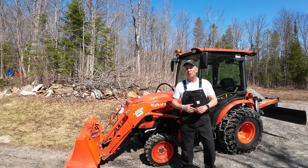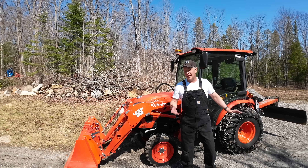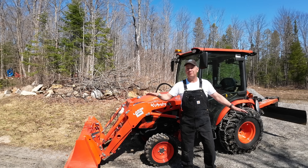I know that this loader and that bucket weighs somewhere around 550 pounds — that's what it says in the manual. I also know that I've thrown over 500 pounds of rim guard in the rear tires. So generally speaking, I kind of have a reasonably well-balanced, stable tractor without anything in the bucket or on the back. Now if I'm going to put things in the bucket, add a grapple, go into the forest, dig up rocks, or bucket gravel, and I'm going to be lifting 500 pounds, I try to make sure I have at least 500 pounds or more on the back. You might think that's wrong, and maybe it is — but in my mind, it's a teeter-totter effect. You throw 500 pounds out the front and start to lift, the tractor needs a counterbalance.